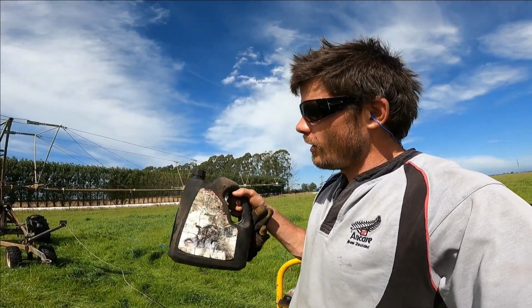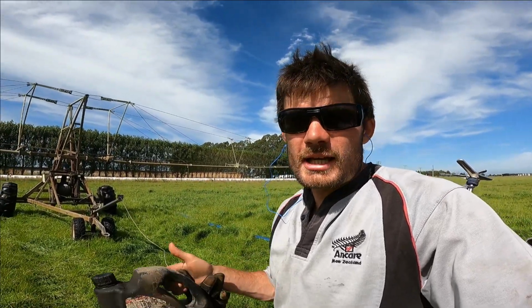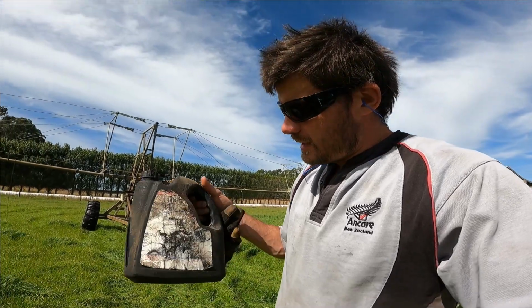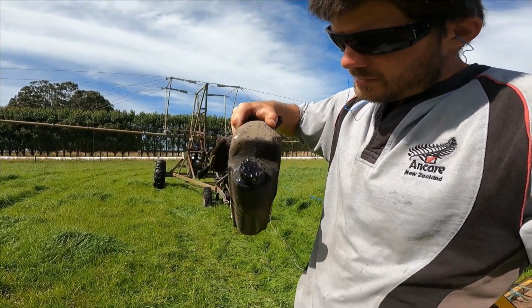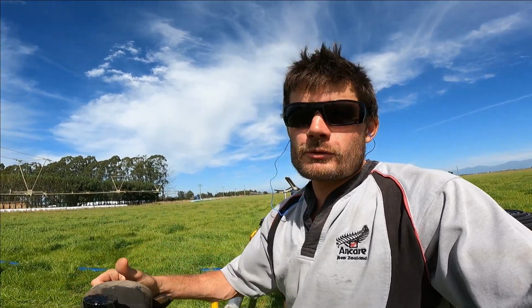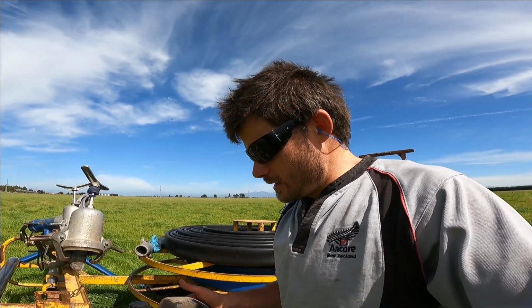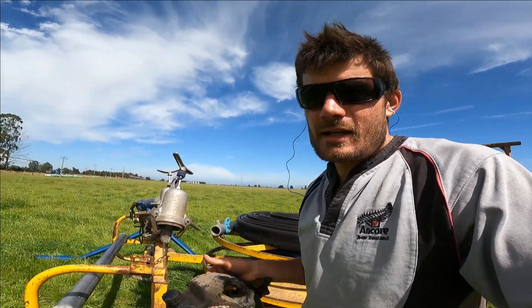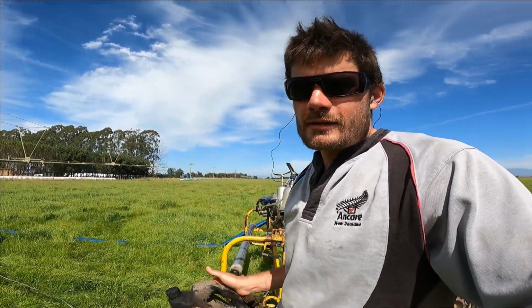Just any kind of old oil that's otherwise going to be thrown away, we throw in there, and it just helps keep that seal supple. What we've done is just got a 4-liter container and simply drilled a hole in the top, about a 5mm hole, and simply just throw it in there. There's a cavity there where the oil will sit, and as the turntable turns around, it'll slowly drop in there and oil the seal up. So that's quite a simple little feature, easy to do, costs nothing, and a great way to use an old product. So right, let's unwind it.